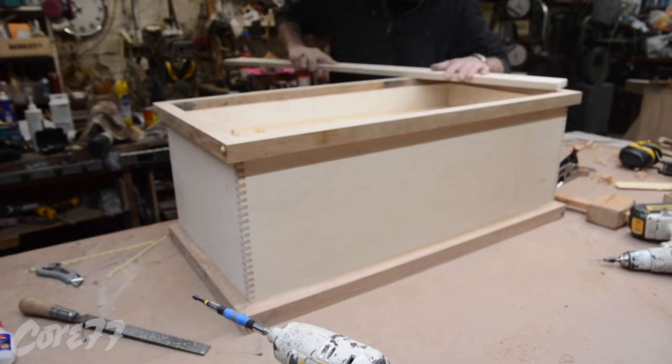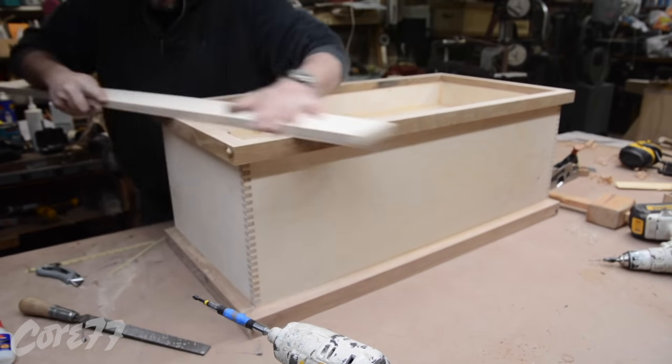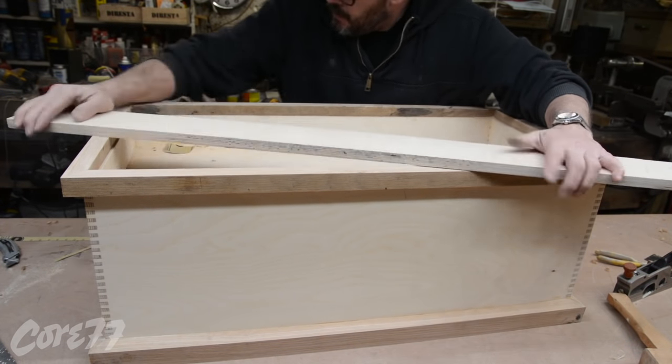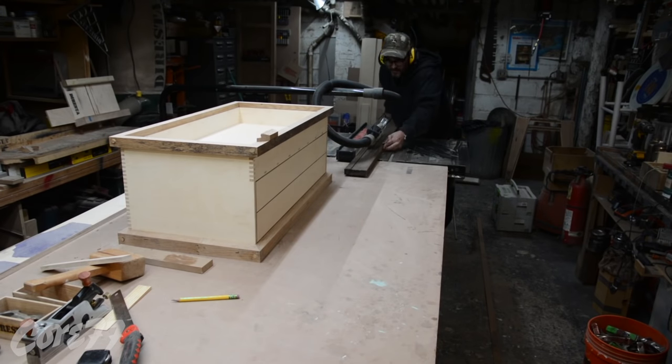This is an important step. I want to make sure that the whole top frame is flat and level, so I make myself a really long sanding board — there's only sandpaper on one end, but having a long board keeps the thing totally flat. This way the whole top bezel will become totally flat.